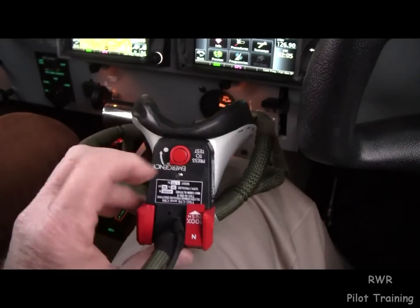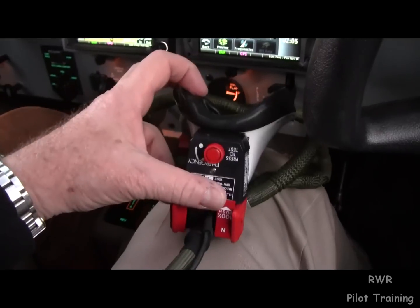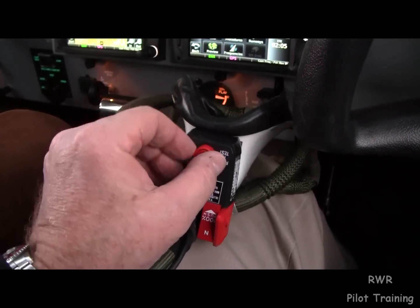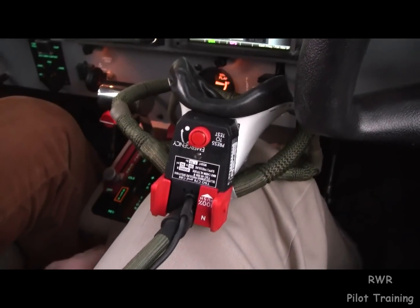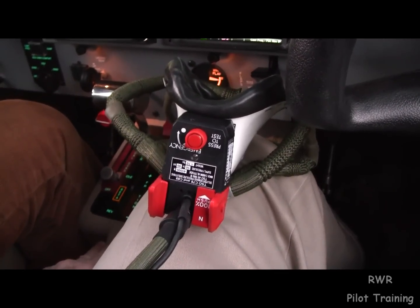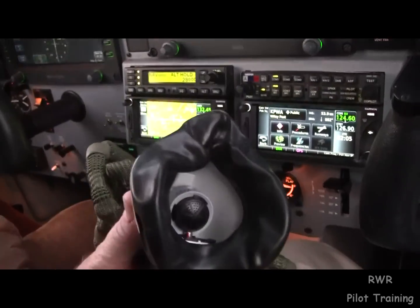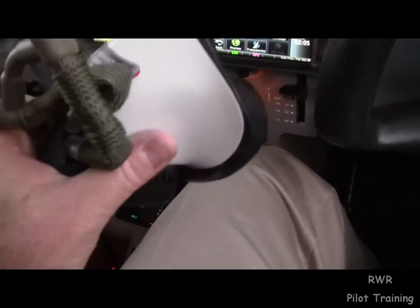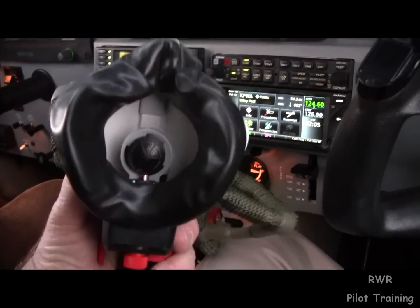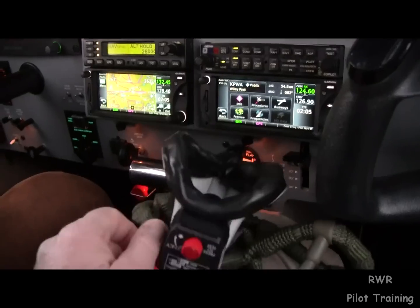There's a 100% lever down here, and the sage advice is to keep that pushed in for 100%. That way, if you have toxicity in the cabin — a toxic smoke — you don't have to fiddle. You can just put the mask on, and in the 100% position, if the mask is a tight fit and you don't have a beard or mustache interfering, it's going to work just fine and give you 100% O2.